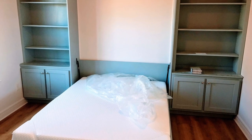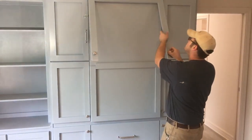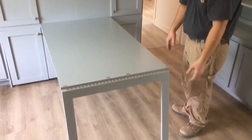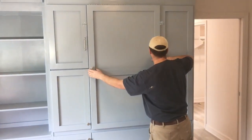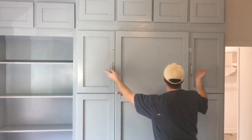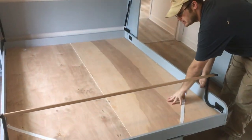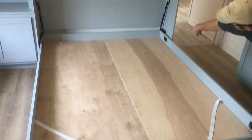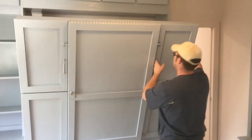Here's our bed with our mattress installed. Here is the big reveal. Our desk is held in place with two barrel bolts, and then there's a magnet to kind of stop it from falling down on you. The table legs are held in place with magnets as well, and there's a chain to keep that leg from coming too far open. When you roll it back up, it snaps into place and then you can secure it with those bolts. This desk isn't going to hold an elephant, but it's mainly for crafting, computer use, those kinds of things. You have two pulls to pull down the bed itself, your mattress sits on top, there's elastic to hold it in place, and then the legs fold down. This hardware is fully adjustable and extremely high quality — it's the only hardware we use, and we think it is awesome.